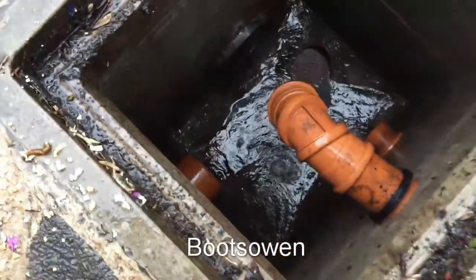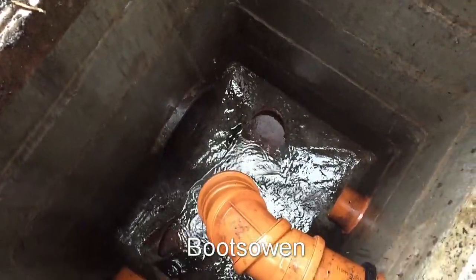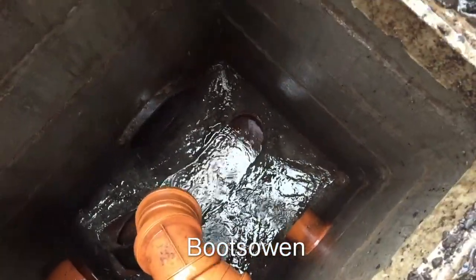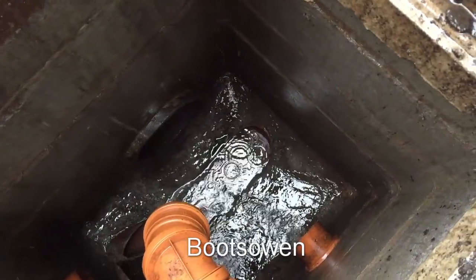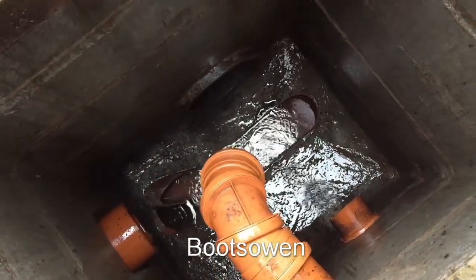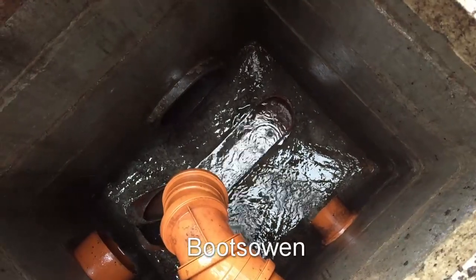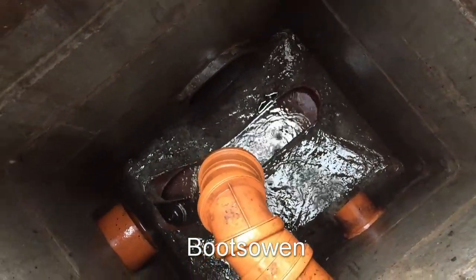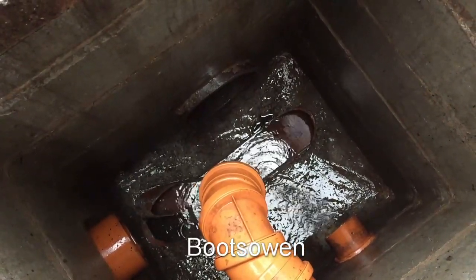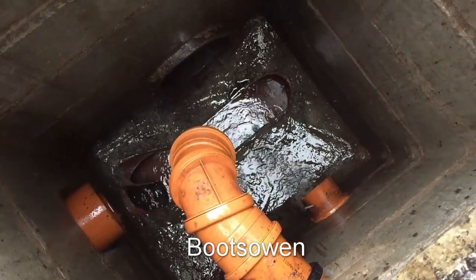See the way it's not drained down completely just yet. That pipe should be empty — there shouldn't be any water in that pipe, but at the moment there's about three or four inches of water in it. I'm reluctant to do this on a day when it's raining, so I might leave it for another day. It does seem to be flowing away but it takes the initial surge and then it's slow, so I wonder if there's something caught in there on that right-hand side.